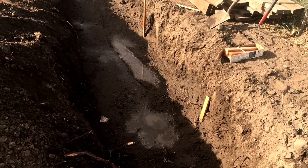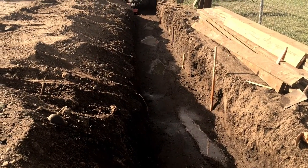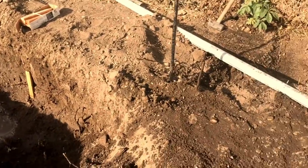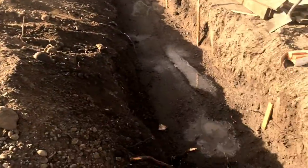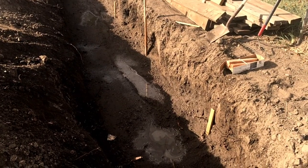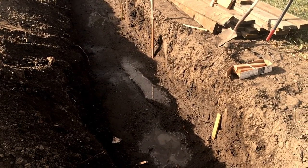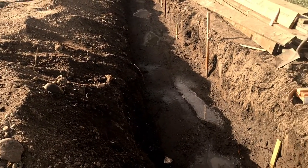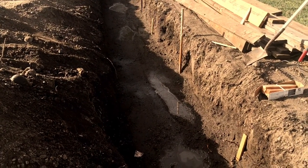There's my first trench I'm working on. I'm going to try to do one side at a time — got some stuff up there to move. What I did is ran the compactor up and down this probably six times on each side, then soaked it down because I've got to put another four inches of dirt on it. The dirt is kind of dry so it's dusty. I'll fill in another four inches of dirt then run the compactor back and forth.